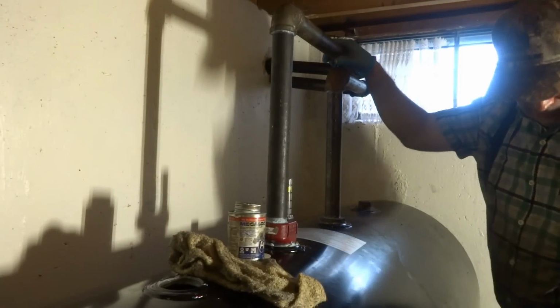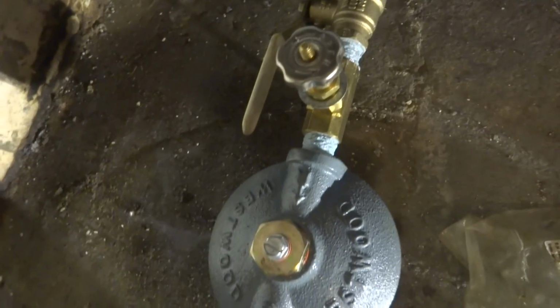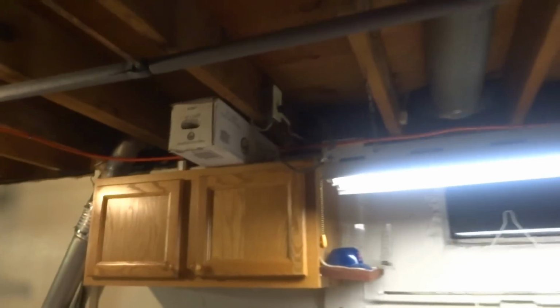Mark the outside, right? Yeah. The outside is going to be a 45. I'm going to put a swing joint on that too because it's a 45. And a street 90. Okay, so you got a half by 3/8 90 on the bottom with a short nipple, ball valve, Firematic, new F4 filter, and I put a check valve. And I went up with the oil line. We ran it all the way down along the edge there, and I clipped it up top out of the way. Came in over here, down alongside this, and to here.